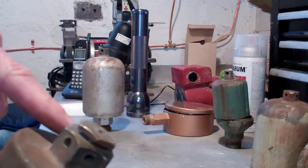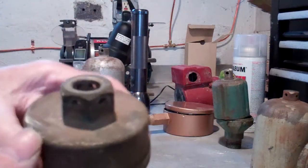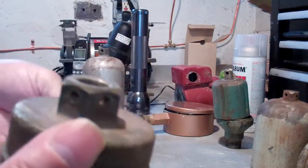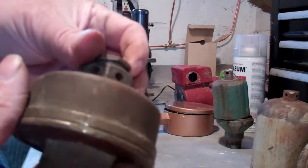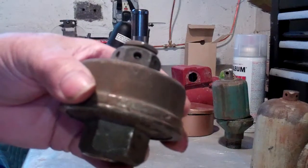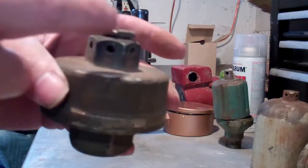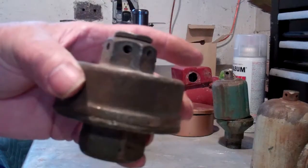These outer holes are misleading. You look at this and think it must be a great vent, but it's actually a very poor vent because there's a tiny hole in the center — that's what you're venting through, not the big holes around the perimeter. It's a well-made vent, but its cubic-feet-per-minute capacity is minuscule. If you have these on your system, you may want to install some better vents for moving air, because fuel isn't cheap anymore.